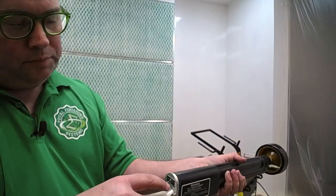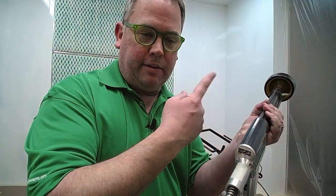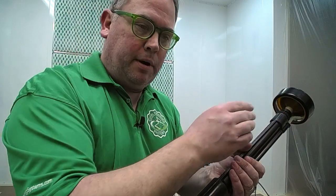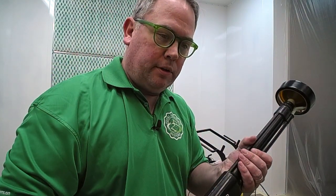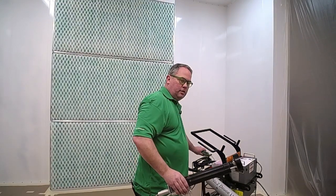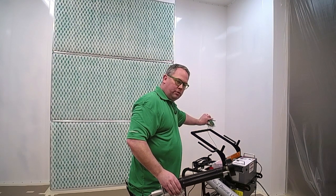At that point, simply turn on the on/off switch on the back of the gun and that activates the mechanical rotation. When you go to clean it, take the bell cup off, clean it with a very soft bristled brush, then purge with the appropriate solvent using the pressure pot. You always want to make sure that this is grounded and that your piece has its own ground. We've also taken this to a firm earthen electrical ground — there's a ground cable that comes on the unit as well.